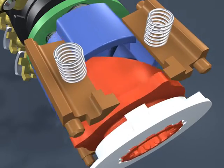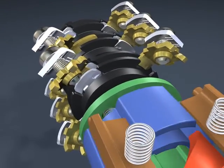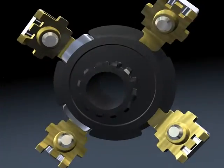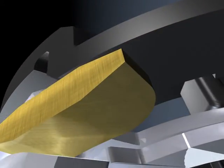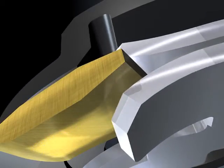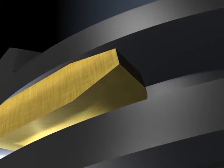The contact chambers of the G20 contain new vibration-resistant knife contacts. The wiping action during making and breaking cleans the contacts and increases contact reliability considerably, particularly when dry circuit or offload switching is the application.